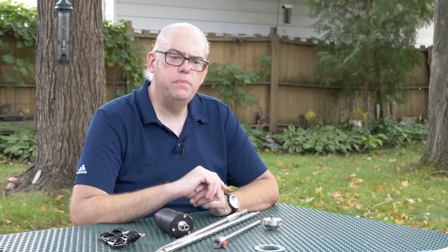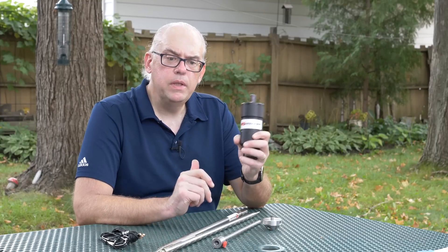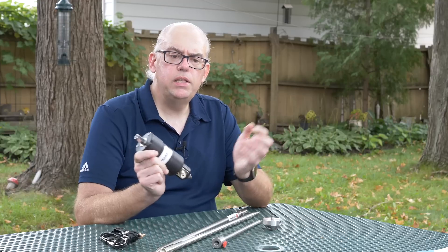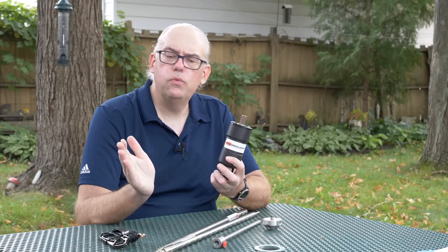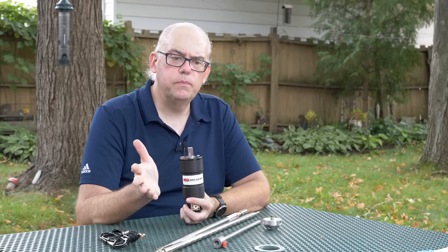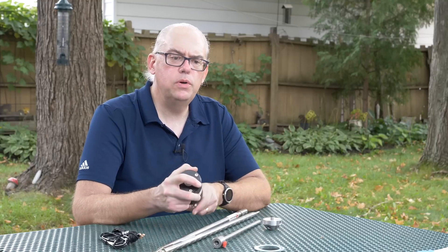Using these components, you will supply your own transformer — like the Hybrid Mini or the Hybrid Micro — and your own spike for the Delta Loop antenna. That's why I'm using the Hybrid Mini transformer rather than the Hybrid Micro. My M-Pass kit has the larger Hybrid Mini, but either the Micro or the Mini will work with the Tactical Delta Loop. The only difference is power handling capability, which is higher with the Mini. Using the Hybrid Micro, Chameleon rates the antenna at 100 watts single sideband, or about 50 watts for CW and digital or data modes.